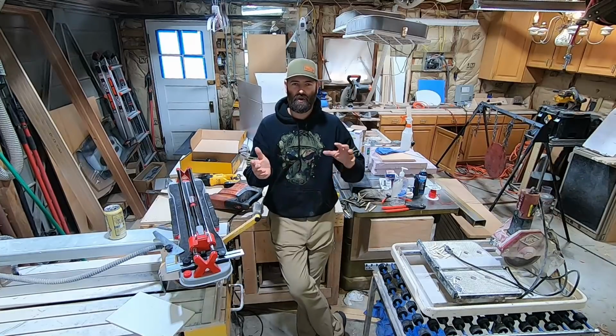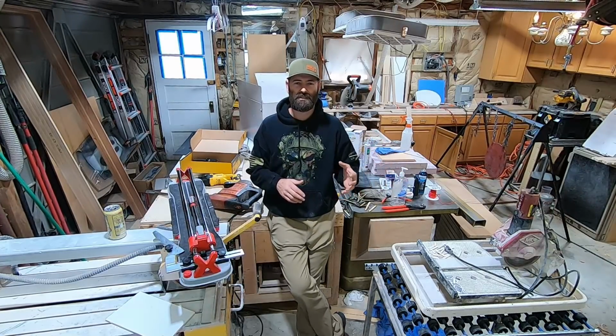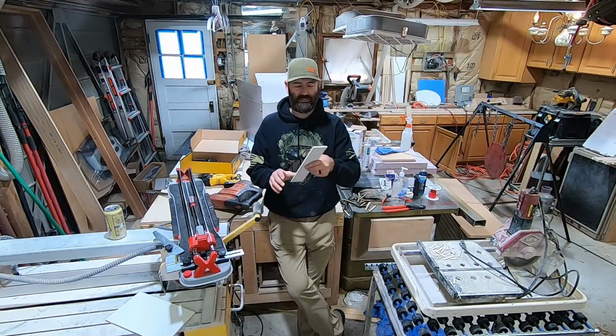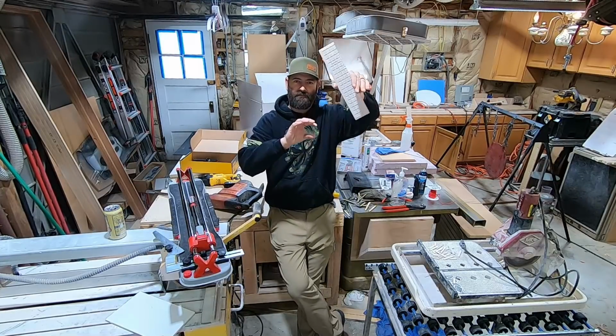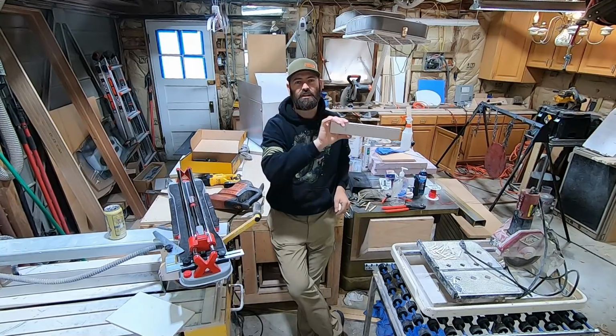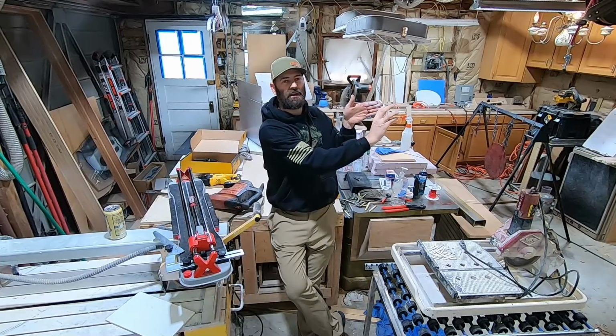Now I do want you to go back and watch my massive backsplash tile installation video, and you'll see that I didn't use a tape measure, ever. All I did was take a piece of tile, stick it up there, mark it, and then flip it, cut it, and the cut edge goes tucked in nicely behind the next tile that would butt into it.